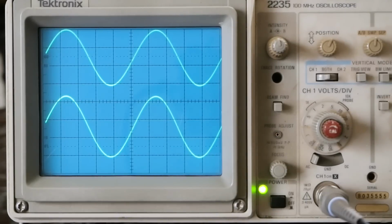So I will say right here, again, this is almost unity gain. So you can see the potentiometer is one of these click types, so it's hard to get right where I want it to be. But even there, at 3/4 volume, the VU meter is reading plus 3 dBs when it in fact is a little less dBs than what's coming in, or a little less signal. And so the VU meters seem to be not really calibrated to show you exactly how much gain you're getting out of this preamp, but they're probably more for decoration, which is what most people want them to do anyway.